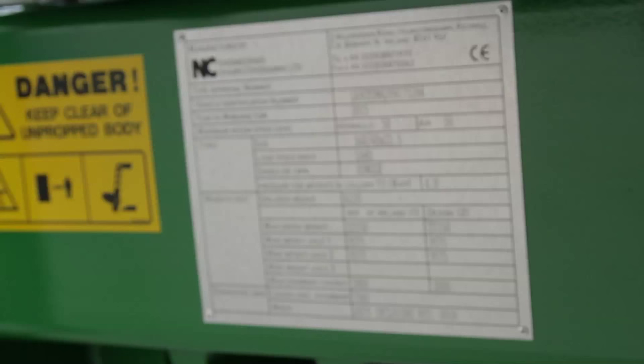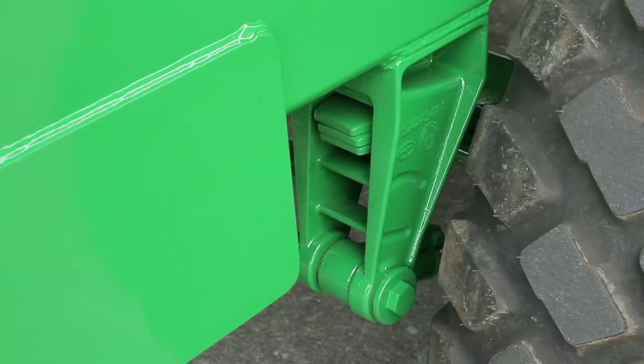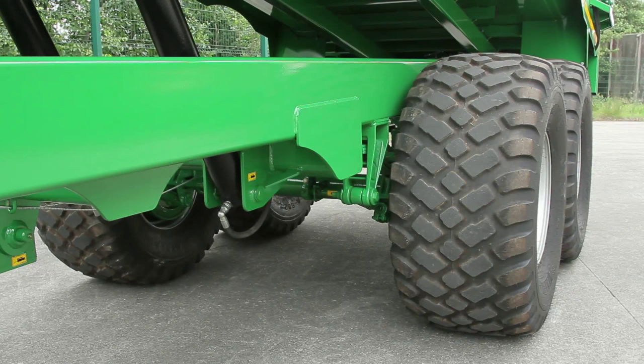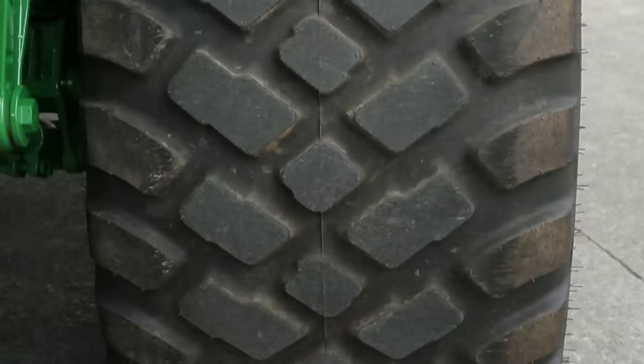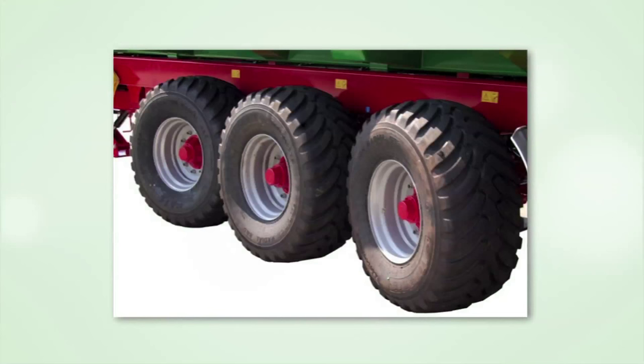These requirements are: they must be plated; they must be fitted with a flexible suspension system; they must be fitted with flotation tires suitable for operation at 10 tonnes per axle in the case of a tandem axle trailer, or at either 9 or 10 tonnes per axle in the case of a triaxle trailer; and they must be fitted with steered or steering axles if they have an axle spacing of 1.8 metres or greater.